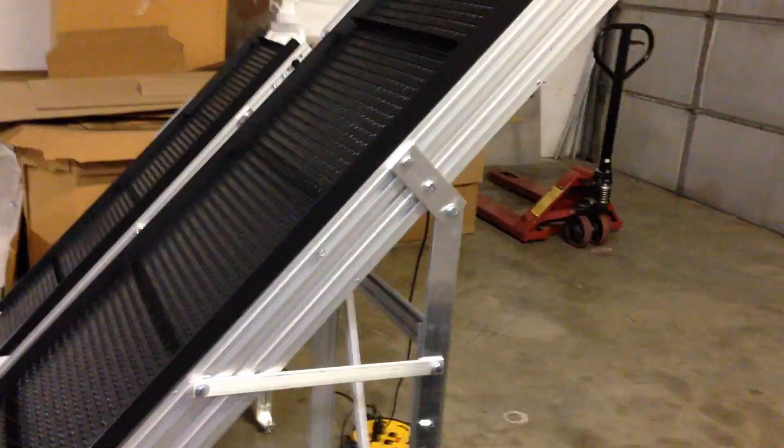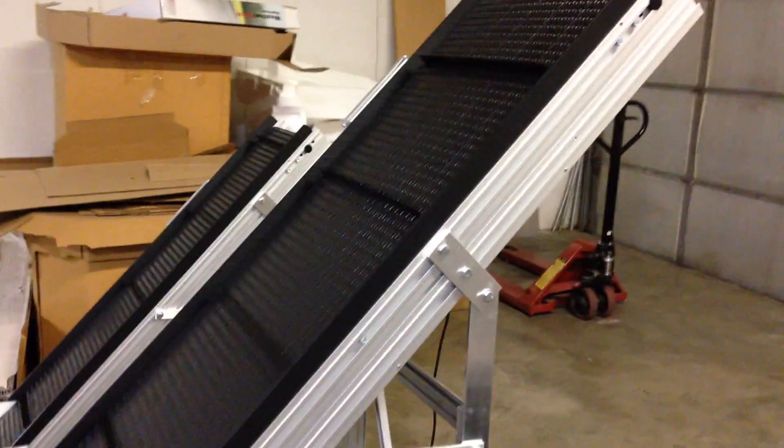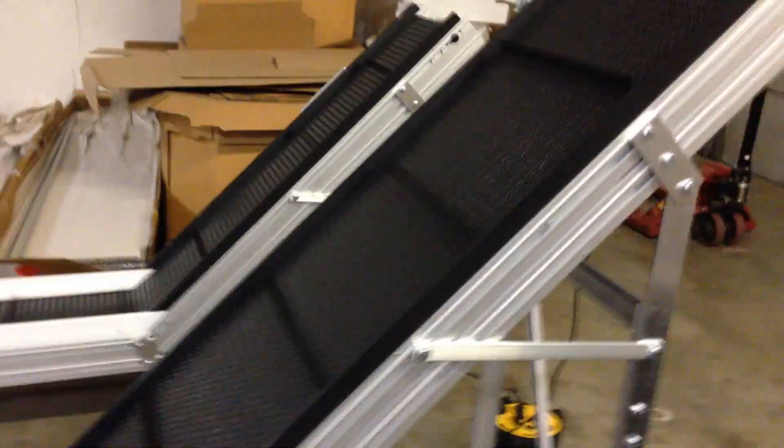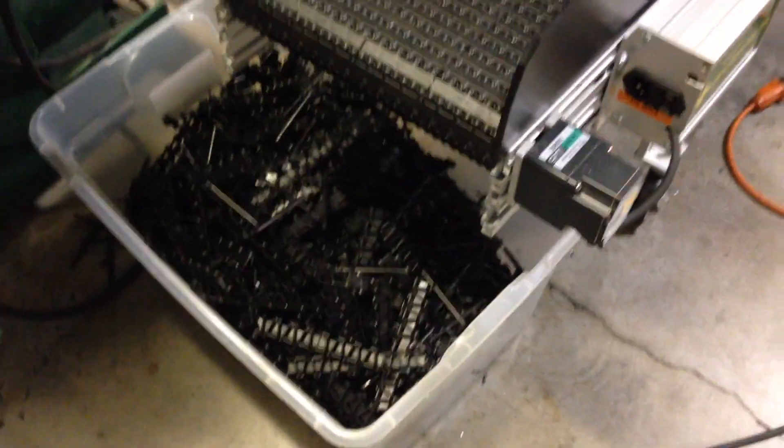You'd also have to start to extend the flights outside of the frame. As you can see on this model and all of our one-inch high flighted models, the belting travels all the way back to the beginning within the frame. So you don't have flights hanging down, which would get hit if they were going through a box underneath there — they'd start banging into the box. Having it inside is a much safer system. One inch high flights can carry a lot of types of products.